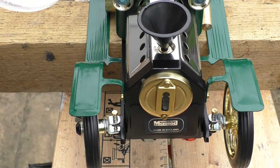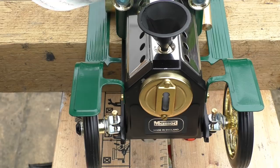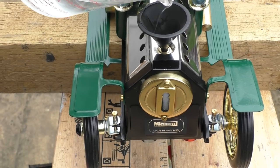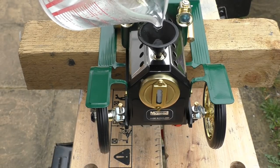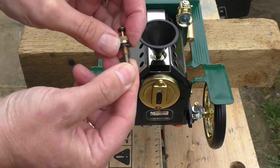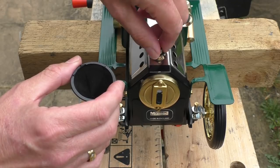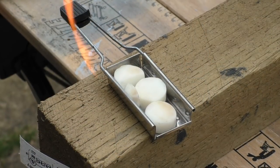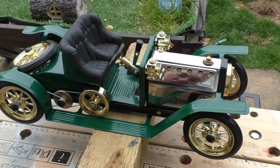Right, let's get the boiler heated. I've got the water fairly nice and hot. I can already see condensation in the boiler — that's spot on, so we're full of water. Just got to put the safety valve back and check it's in operation — this just goes in finger tight. Right, I've got a little cloud of steam now just coming out of the safety valve a little bit early, but I'm a little anxious so I'm just going to see if she'll start.